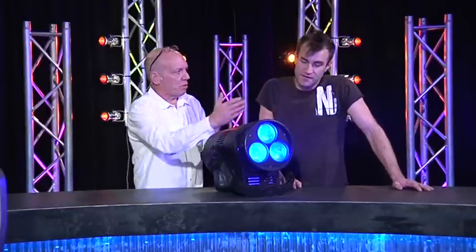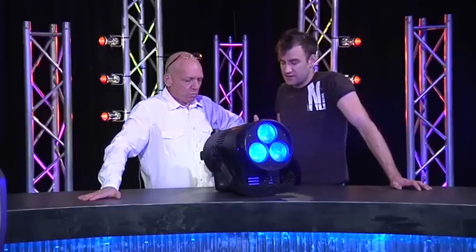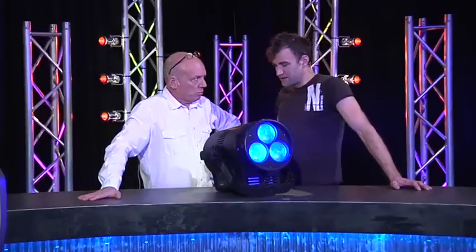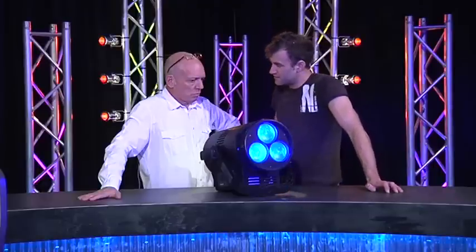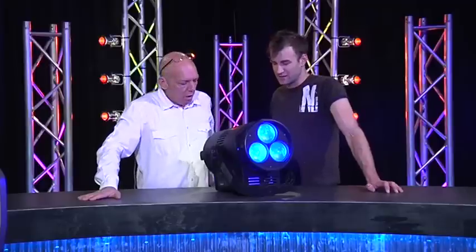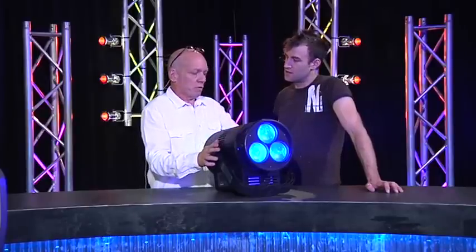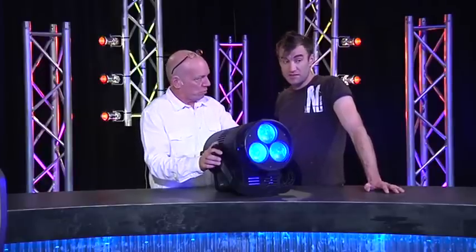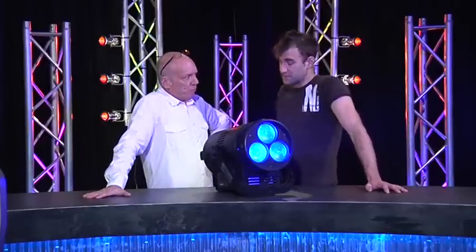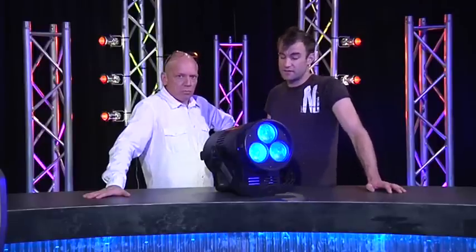Talk about colors. It's an RGBW system and you've got different color temperatures which can all be recalled off the side. It's easy to control over DMX — it's a really nice fixture. Right now we've got a really deep saturated blue dialed up. The particular engine has a very high CRI, or color rendering index, so it's going to give you accurate rendition of colors if you're using it to produce white light.